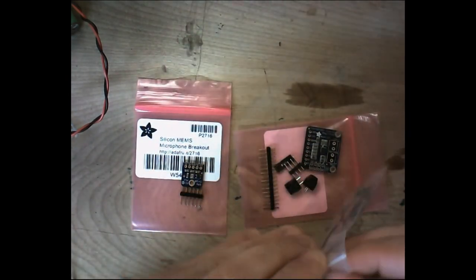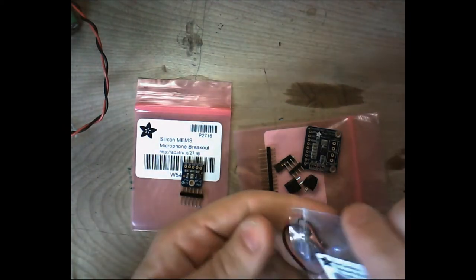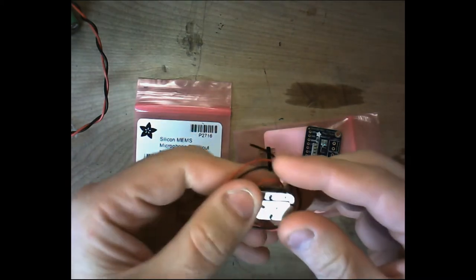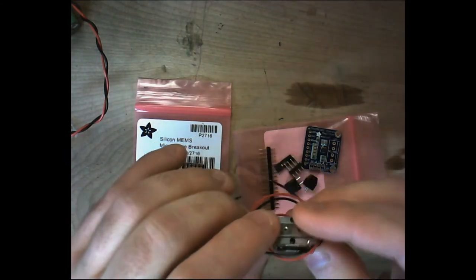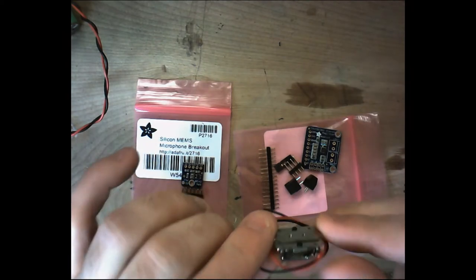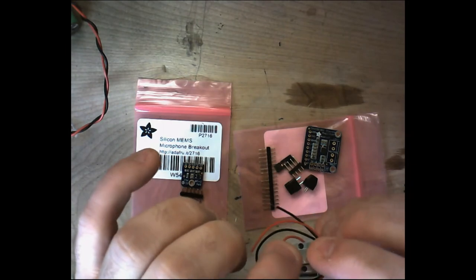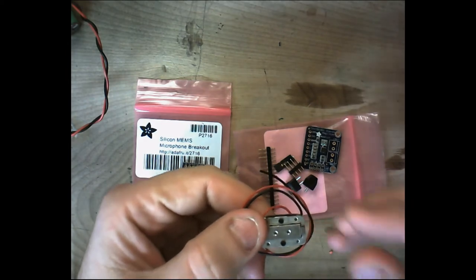And then, of course, the last piece, which is, like I said, what I feel is the most special. And this is the same circuit that I use in my own helmet, so I know it works well. These are the bone conducting transducers. Now, what these do, and I'll explain the principle behind this, is turn the electric signal, instead of vibrating a cone, which moves air, into vibrations of this little metal plate on top, and that metal plate will sit against your head, preferably close to your ear.